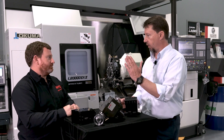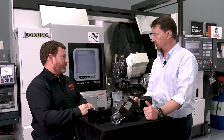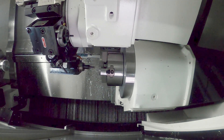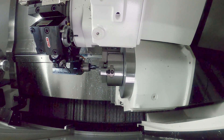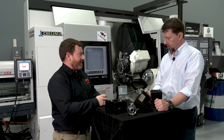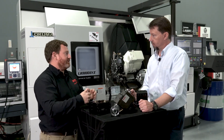So I don't have to program any retraction moves — it's basically just a straight linear feed in the X-axis. You just turn on your RPMs and your feed. Our unit is a one-to-one ratio, so up to 1,000 RPMs or 1,000 strokes per minute, which is 17 strokes per second. We can actually run it that fast and make your keyway in a matter of seconds. And every single stroke it's retracting and then coming back in, which helps with tool life and surface finish.